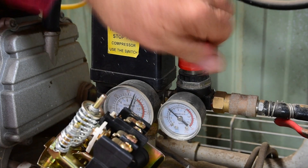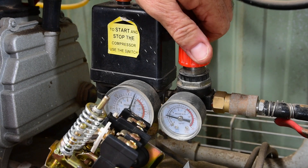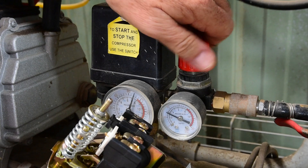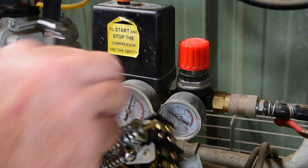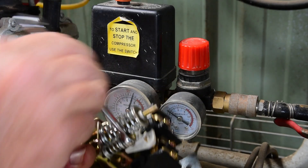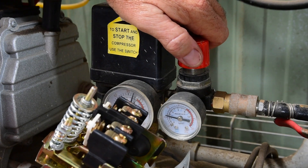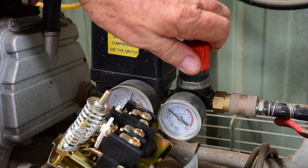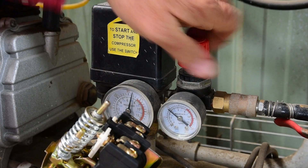So I'll just get that to turn on again. Now I want that pump to turn off at 60. So you wind that up until it gets to — I've gone the wrong way. So I need to wind that down. I wind this one down a fair way — that's two turns, three turns, four turns. I'm pretty sure that'll be well above 60, so I'll bleed the pressure off until the pump comes back on. Watch the contacts close at 30 psi. Now I want the pump to go off at 60, so I need to go a little bit more. Just run through that again — it's a little bit time consuming, but it'll get you there.